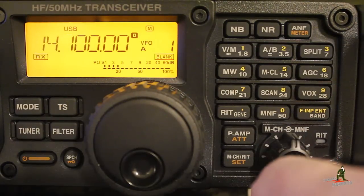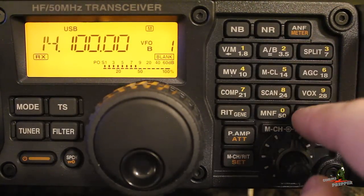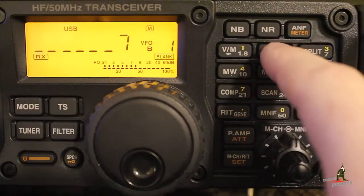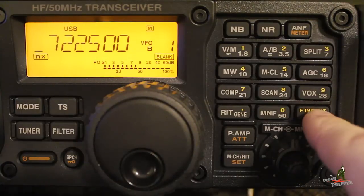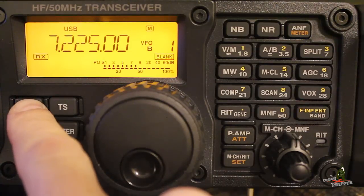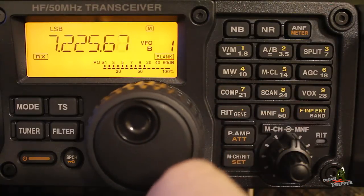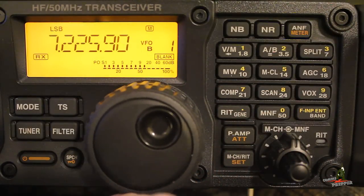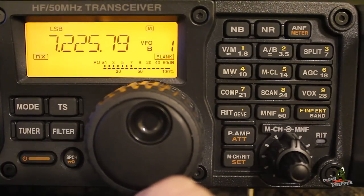We'll return to radio mode. Now I'm going to tune up a frequency — here's something that took me a while to figure out. We'll go down to the 40-meter band and listen to some traffic out there. We're going to set the mode to lower sideband because that's what we use in the 40-meter band, and we're going to try to tune in.